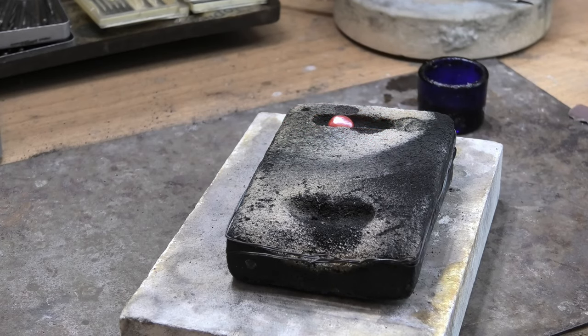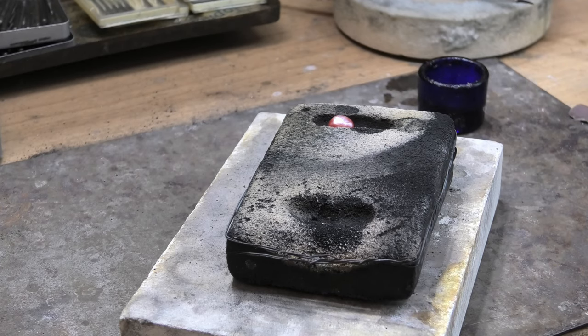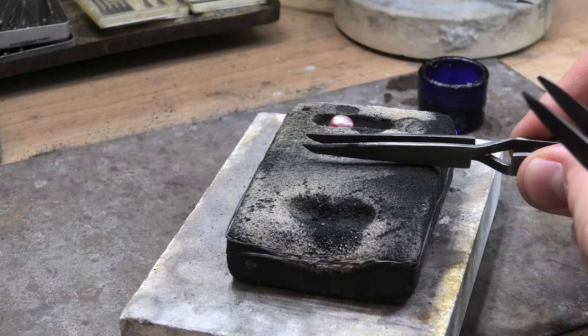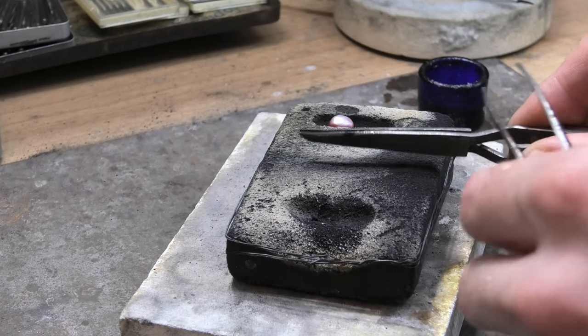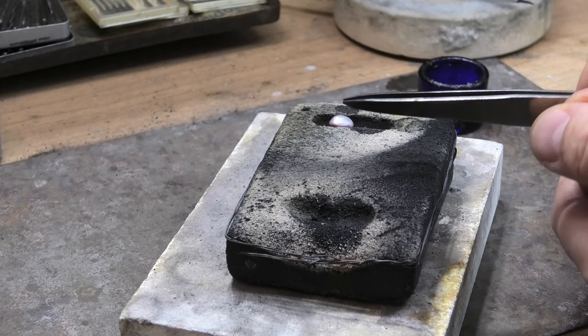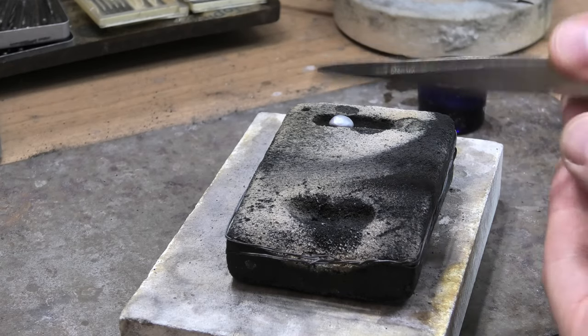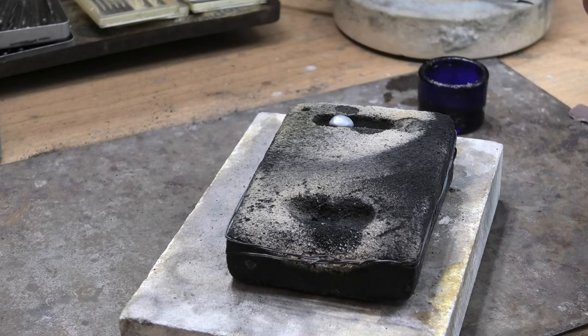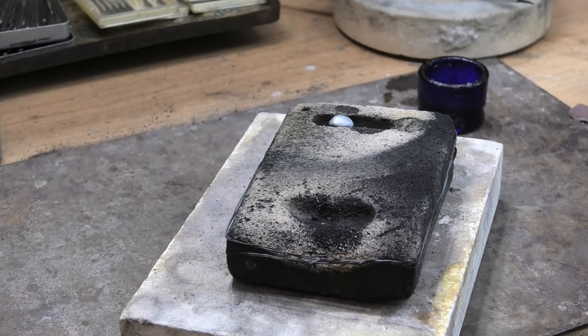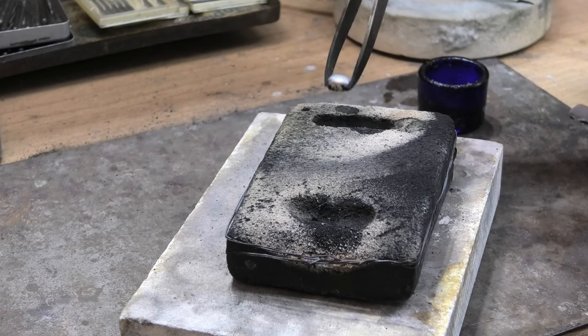So that's melted. I know some jewelers will melt it on a flat surface, then get a pair of pliers and squash it and hold it there so it goes solid in a nice useful long flat-sided shape. I don't recommend doing that because you're changing the shape of the metal as it cools very quickly, and you can cause internal little fractures and cracks — the metal goes from liquid to solid while you're moving it and it can muck it up. You're far better off having a groove where it melts in the shape you want and then just let it sit until it goes solid.